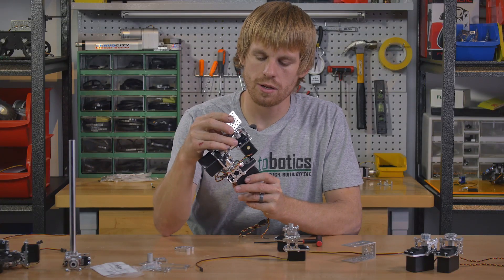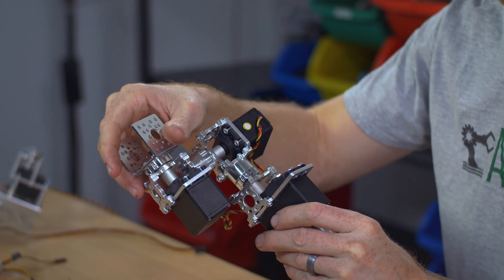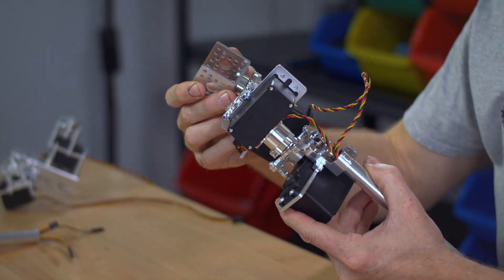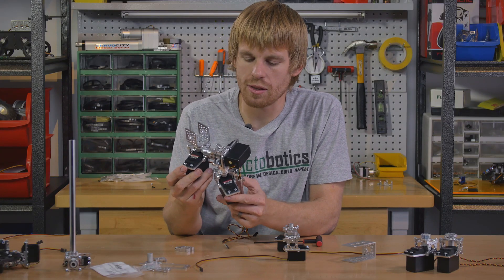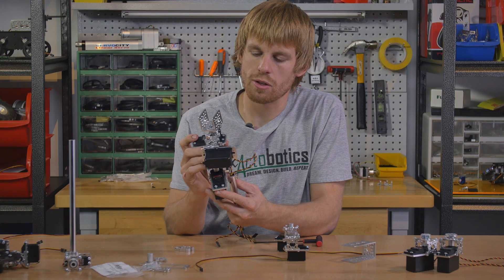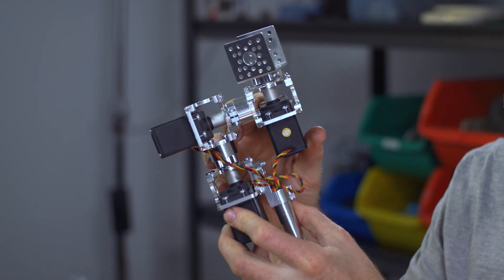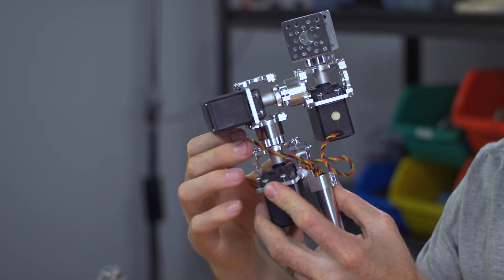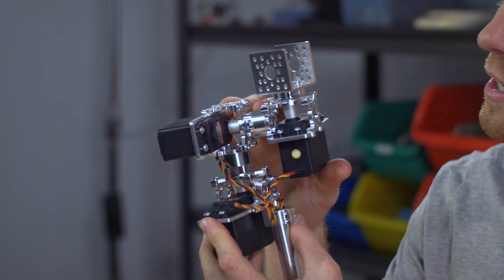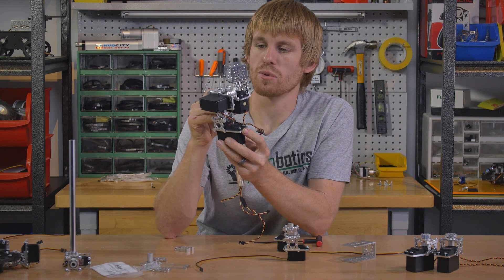Servo blocks get used in a lot of assemblies — they get pretty intricate — and so we've brought some in to show you different ways you can attach them. If you want to build a multi-axis rotational assembly, maybe for animatronics or something like that, you can bolt them together really easily. In order to allow clearance for these to rotate around, I put a hub spacer in between the first one and the second one, and also between the second and third. That way you have enough clearance for the thing to rotate around without your servos touching one another.